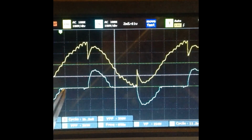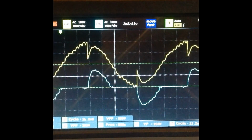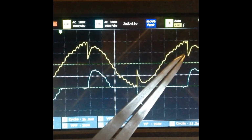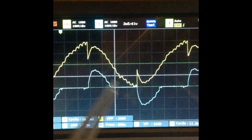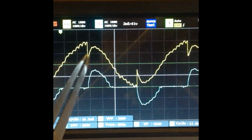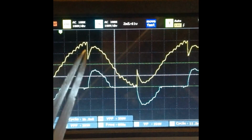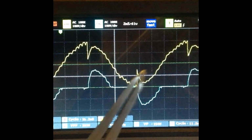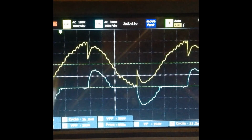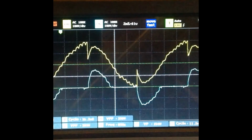It's having a little trouble locking in, as the sweep is a little off. But as you see, the driving waveform has a significant deviation in it. And this is only a 500 watt load. So the driving waveform, you know, I don't worry too much about the waveform going to the lamp, but any other device connected to this generator in parallel with this 500 watt incandescent load on a dimmer is going to experience this deviation in the waveform.